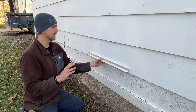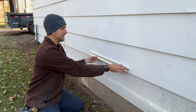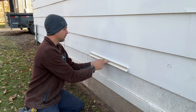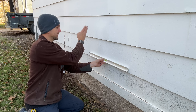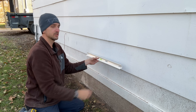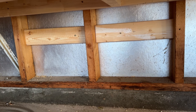The bracket I got is just at 30 inches long, so you have to think through how you're going to attach four lag bolts to secure this, because studs are typically placed 16 inches on center — that gives us 32 inches — which means this is just a little too short. So I have to put a few blocks in the wall, and that's what will give me a secure backing to sink these lag screws.